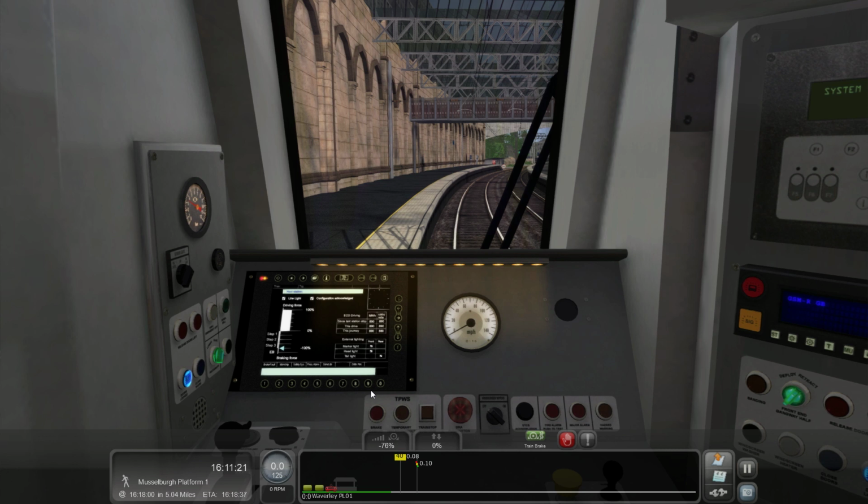Entry and access to the driving cab for the Class 380 EMU is via manually operated single leaf sliding plug door. From ground level access involves utilising a bogie mounted footstep and interior mounted handrails. When entering or leaving the driving cab, drivers should be aware of the possibility of the alignment of the footstep being different from expected, particularly on curved track. Always take time to ensure you have 3 points of contact, including a secure footing on the footstep before climbing down, descending from the cab to trackside.